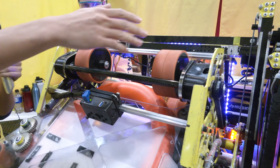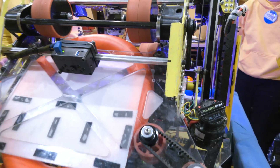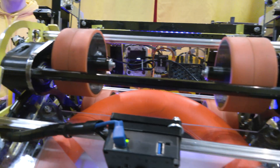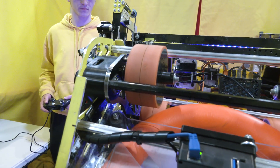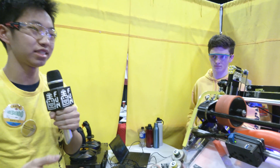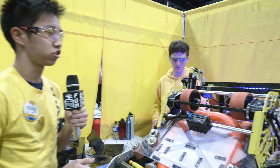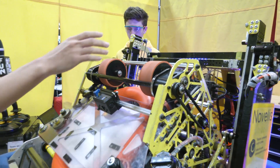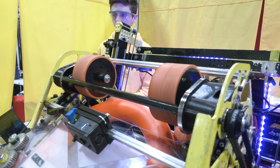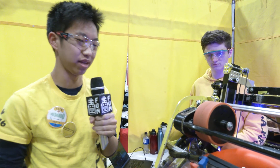Another thing is that these two wheels are not mechanically linked in any way — something we designed just for this event. Previously we had the top wheels mechanically linked, and we put spin on the note by offsetting the wheels off-center so they touch the note at different points and release at different times. However, we found the shot would curve to the left and sometimes be inconsistent. By opting for two separate non-mechanically-linked wheels, we can spin them at different speeds to add spin without the curve. This is something we saw a lot of other teams doing and thought it would be good to implement ourselves.